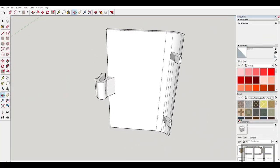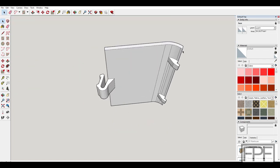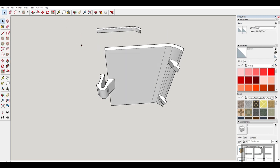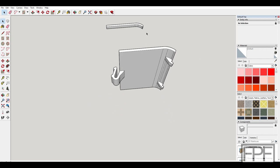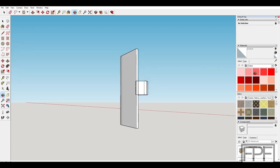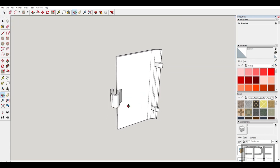Here's the design I came up with, and it actually didn't end up being too hard. The trickiest part was just figuring out the correct arc following the back of the alarm clock. I drew that face first, and I did a couple of test prints with this extruded up a couple millimeters, then just matched it against the alarm clock until I had that arc the way I wanted it. In running that test print to get the arc right, I also realized that the best way to print this would be standing up like this — with some tree supports.